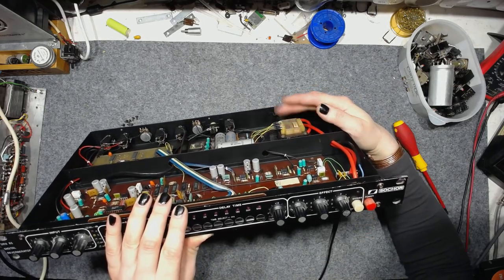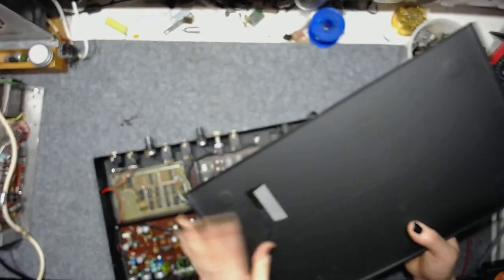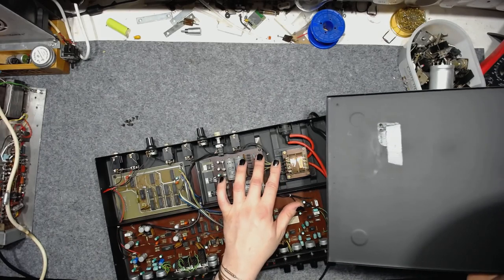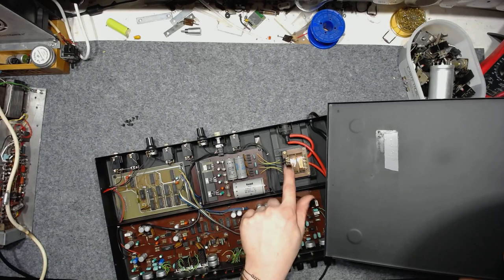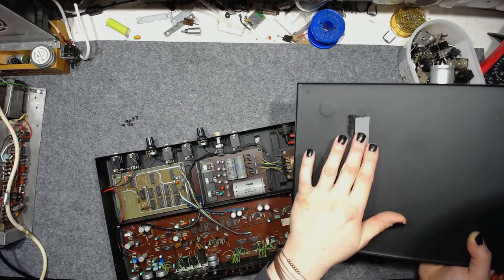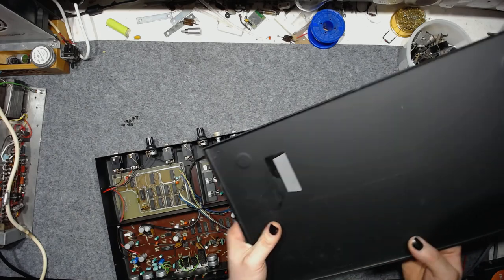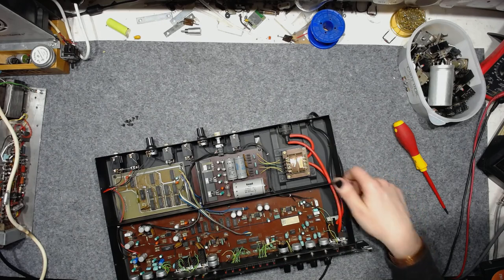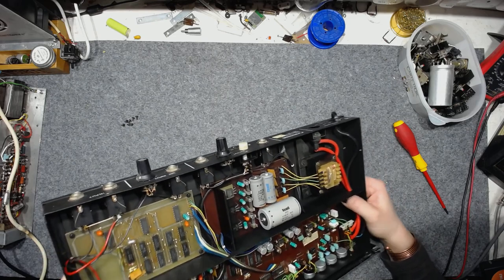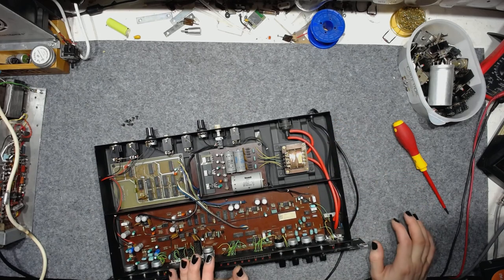By the way, there's one more thing that worries me quite a lot. This transformer sticks out so much that the contacts make contact with, fortunately insulated, part of the top cover, but it should have been designed way better than it is. Maybe using a toroidal transformer would be a nice upgrade for this unit.